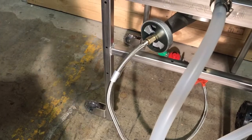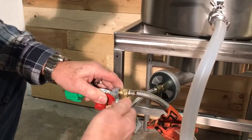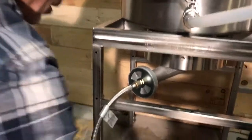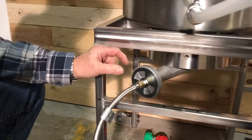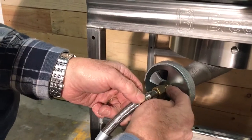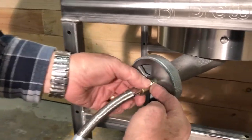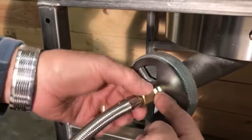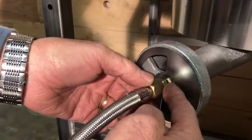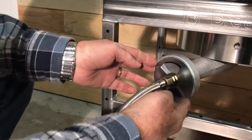Your wheels go down here on the bottom. And you need to hook up the regulator. The regulator has a needle valve on there that controls the flow of the gas. It'll come with a little brass jet — you won't need that one. The one you'll want to use is the one that's in the burner. Make sure that's finger tight. Put a crescent wrench on the backside and then tighten up the regulator side good and tight. Hold them together so that you don't tighten it up so much that you can't use your airflow control.